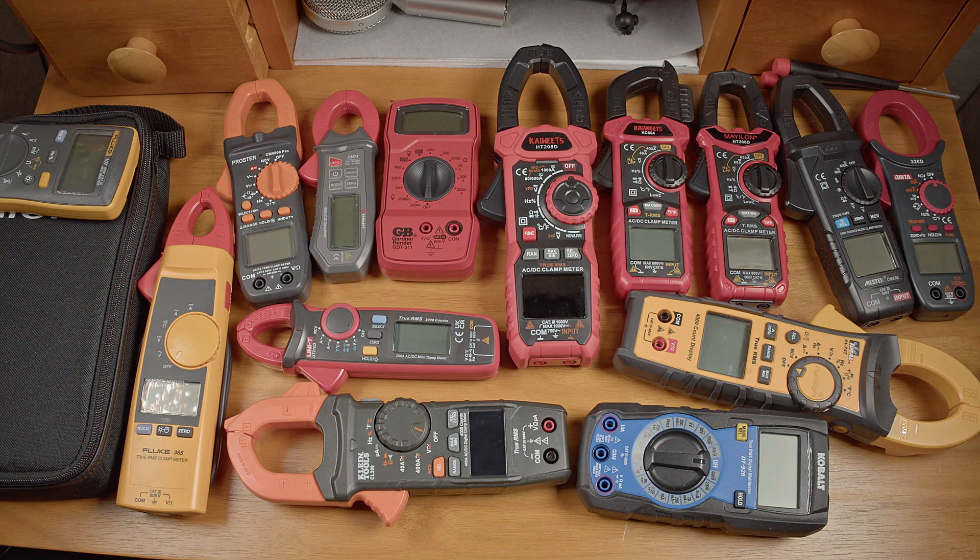Ultimately, all of these meters technically worked, but some of them are over 10% off in some situations. So if you're considering any of these meters or any other super cheap meter, consider how accurate you need the readings to be. If a test tool gives me an inaccurate result, it might just take me from not knowing to being confidently wrong. Exact accuracy isn't always critical, so just keep it in mind if you're looking for a cheap meter. Hopefully this was helpful, and maybe I'll try a couple of these meters on a MIG welder later too, just to see if the noise profile affects the readings differently than a stick welder does. I may end up giving some of these meters away after that video, so be on the lookout. If you have any questions or anything else you want me to test with these cheap meters, let me know. And as always, thanks for watching — take care.